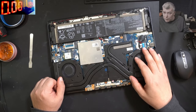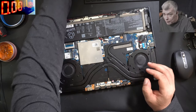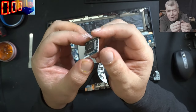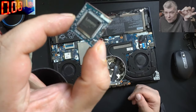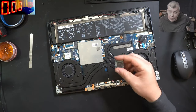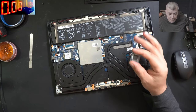I have a guy giving a second opinion saying the EC chip is 256 kilobytes but the correct firmware is 192 kilobytes. I'll show you the EC chip and where I order from. The chip came from China - check this - they cut the board instead of desoldering the EC chip. Can you believe that? So I'm going to program this EC chip with 192KB firmware, solder it back on the board, and see if that fixes the problem.